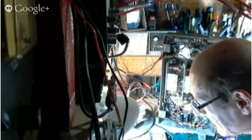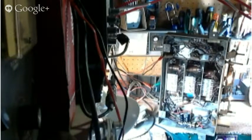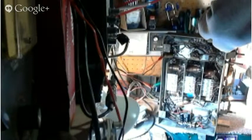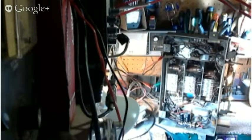Primary and secondary, and you know, I cannot tell primary from secondary, but it may not matter. It may not matter the order of that precisely. Okay, a little awkward doing this. Now I'm looking straight at the meter while I adjust this. So you cannot hear this. The adjustments are so precise. You do a bad job of this and you've got a radio with all kinds of spurious signals in it. Well, here, I'll detune it. Okay, so you can hear it disappear and I'll retune it. Beautifully smooth action on this. Okay, do the next.